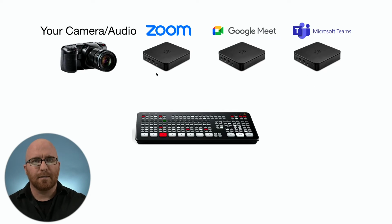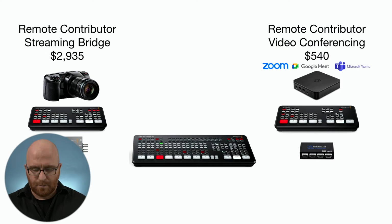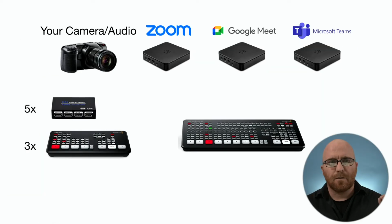And so with that, let's see. What we want to look at is your camera and audio source, how you're getting into the Extreme, how you're going to bring in up to 3 other contributors with you. So let's say one's on Zoom, one's on Google Meet, and one's on Microsoft Teams. To make that work, oh, sorry, wrong way. You're going to need a few other things. To return the feeds to all of them, I would recommend that you get 3 additional ATEM Minis. You probably already have 1 or 2, so maybe 1 or 2 more, and a number of HDMI splitters.